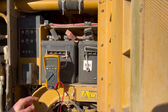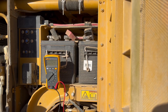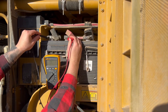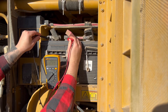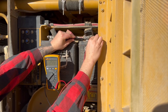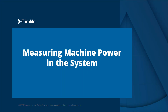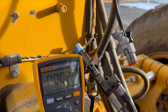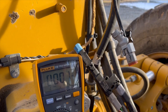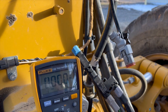Here we have two 12-volt batteries in series, meaning the two readings combined will add up to approximately 24 volts. You can check for voltage on any cable in the system that is coming from the source — you just need to ensure that the machine is powered on.